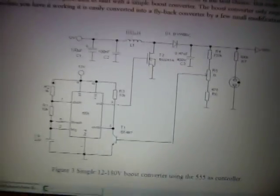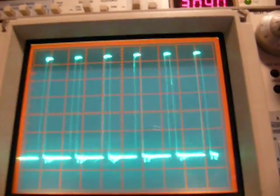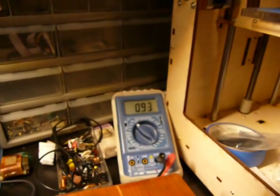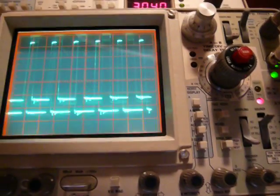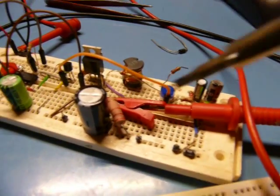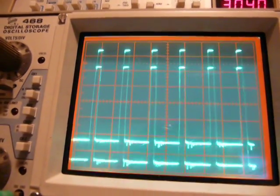Let's see this in action. I'll make sure everything is safe here — got my voltmeter. I'm going to power this on. As you can see, it's at 94 volts, and here's the output waveform. Let me save a reference. This blue pot here is the pot you saw in the schematic. I'm going to tweak that upwards a little bit — say around that. As you can see, now these pulses are a little bit wider because it's trying to maintain a higher voltage. I'm loading this thing down with this resistor here, which is just a dummy load. It gets quite hot, so I'm going to turn that down now.